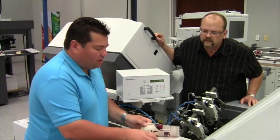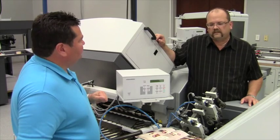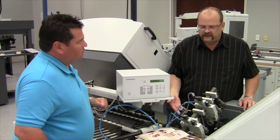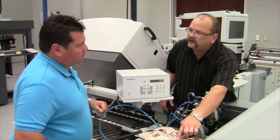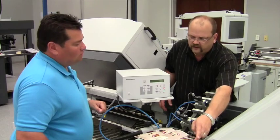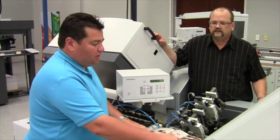To set the timing up with the controller, you have a photo sensor on the end feed. You set the time from when the photo sensor sees the sheet until when you start the perf, and then the time for how long the perf is going to be. All we're doing is giving it a time for the start point and an ending point — it's set up as a controller.